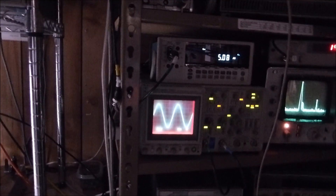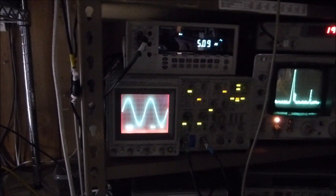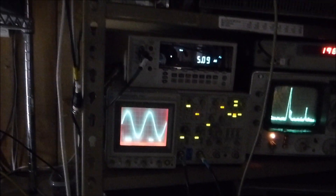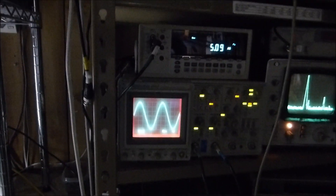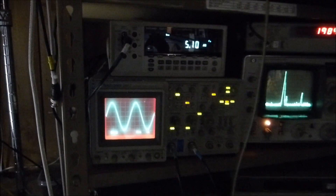It's got a magical sound to it, I'll admit. I did order some new speakers — the old ones are 88 dB, and the new ones are 98 dB, so I get 10 dB of gain right there, which is twice the volume level.